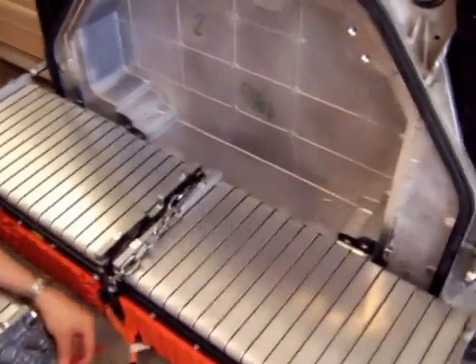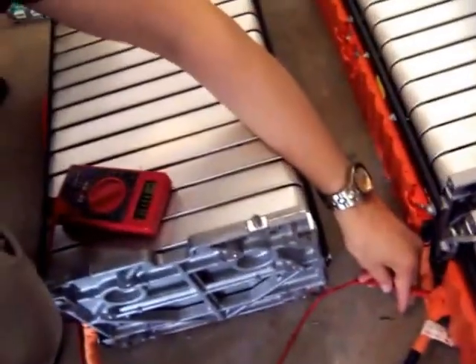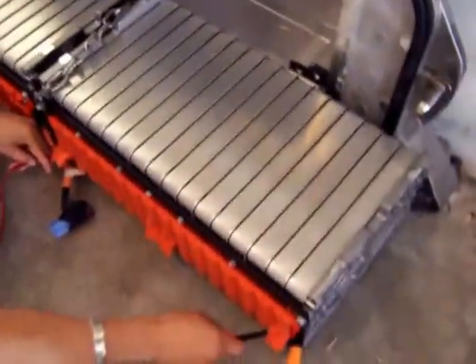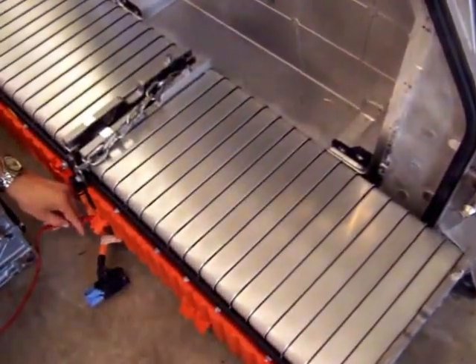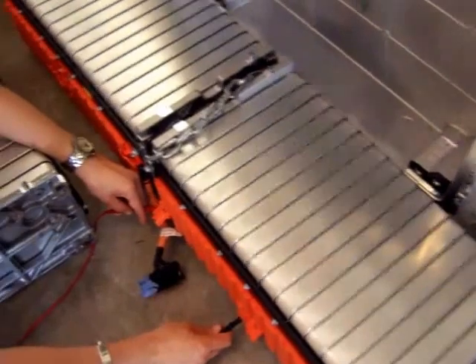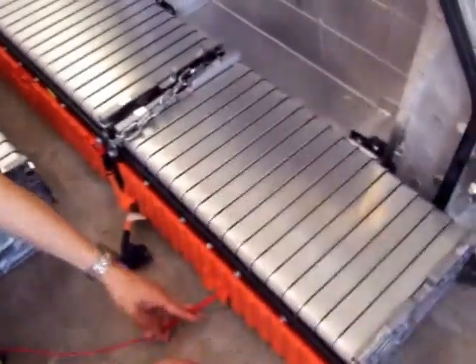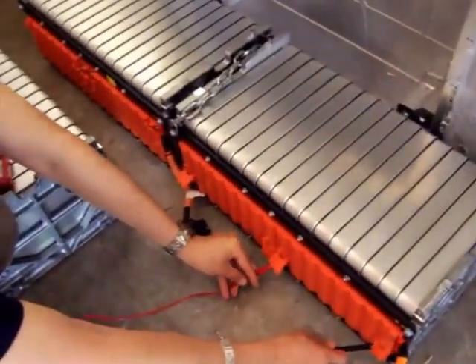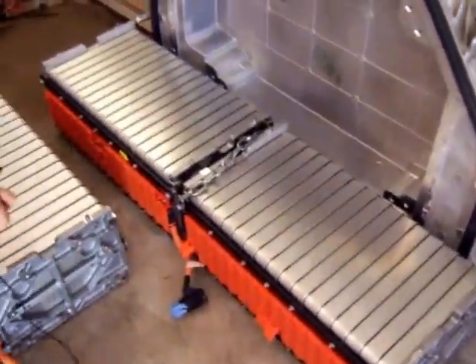It's very well balanced, actually, surprisingly. When I check this last package, this may have a different configuration. When I check in here, I get 63 volts. And when I check from here to here, I get another 63 volts. So they may not be connected internally, which I have to check.